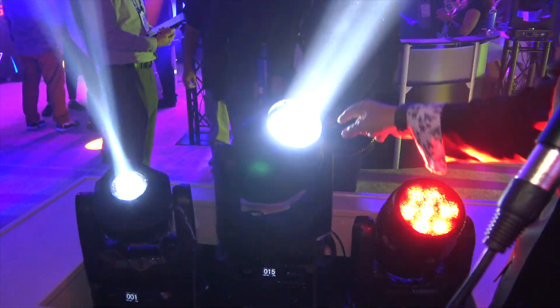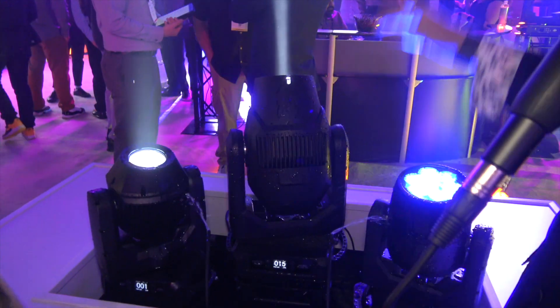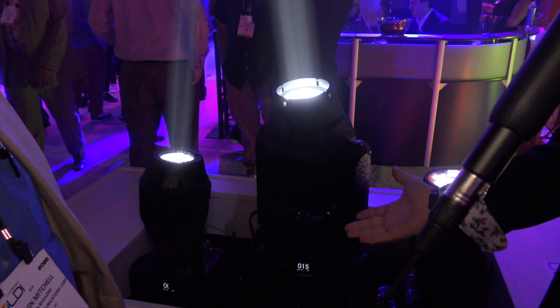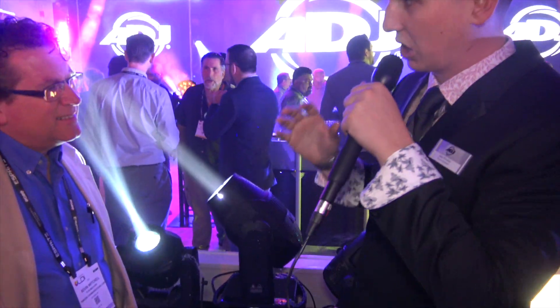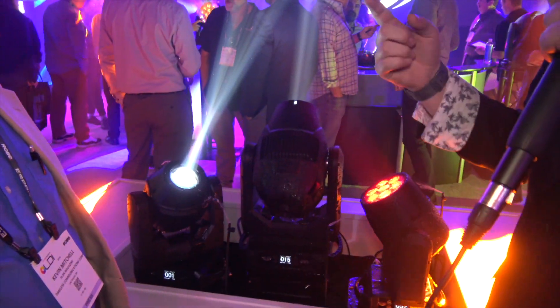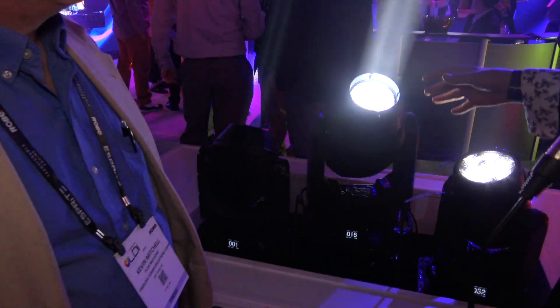Moving on to its bigger brother, the Hydrobeam X2. This takes a huge step in wattage output — this is a 370 watt discharge lamp rated for 6,000 hours. Here we get a lot more bonuses: you have a standard gobo wheel that's actually replaceable so you can put your own custom gobos in. Shoot it 600 feet to a completely different building if you want. We also have two different prisms that are overlayable, and there's a color wheel with one extra special thing — a four-color dichroic glass so you can do multiple color beams from one angle. Two prisms and a frost as well for some washes, and there are awesome 3200 and 5700K color filters in there for nice color correction at outside festivals.